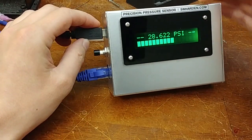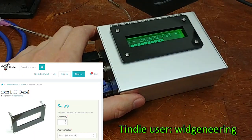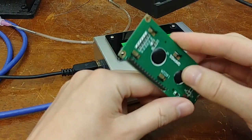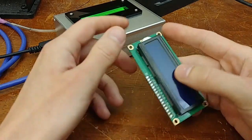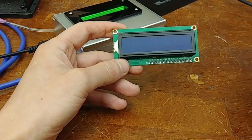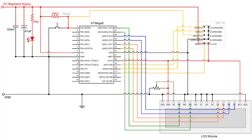I want to give a shout out to whoever made the little bezels for LCD screens. These are the standard Hitachi-type LCD screens that everyone uses — extremely inexpensive, especially from China, typically 16 characters wide by 2 rows high. They communicate with about 6–8 pins on a microcontroller. There are also I2C controllers for these displays available on eBay that let you control the display with only two wires, which fits perfectly with this project since we're already using I2C.